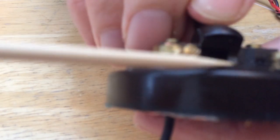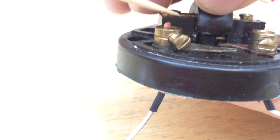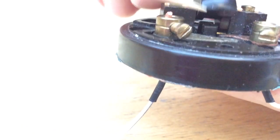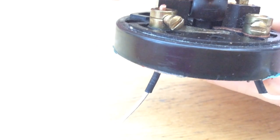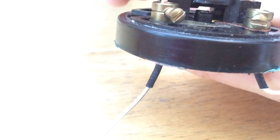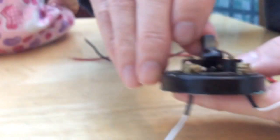At the moment it's open. I'll operate it a few times — open, closed, open, closed, open. It's very difficult to see, but there's a little piece of metal there on the right-hand side moving. There we can see it clearly — it's closed, open. When it's closed it's touching, completing the circuit between the two wires; then it's open and the circuit's broken. When it's closed, electricity can travel from there through there and down through this one.